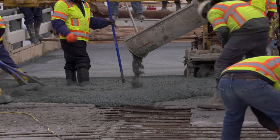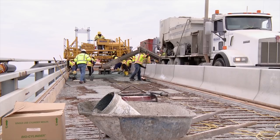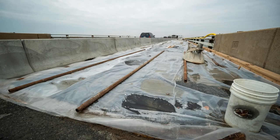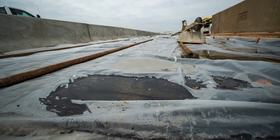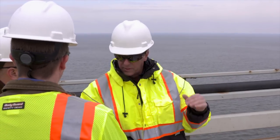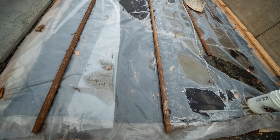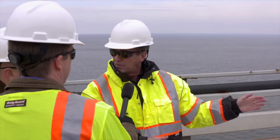You can see they've done about 20 feet since we've just been standing here for five minutes or so — they're rolling. There are people behind them who will lay the burlap down once it starts to cover up the cement, to allow moisture to continue to get into the cement. Then they'll put plastic over top, then a black blanket so that it absorbs the sun rays and continues to heat up the surface to maintain the constant temperature needed for the cure. Then they'll put plastic over the blanket and some pipes down to hold the plastic down. It's a very intense process with a lot of labor.